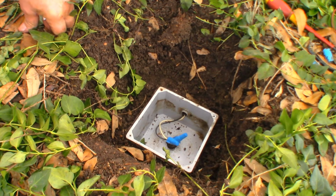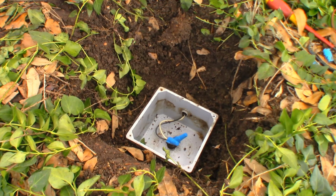So that's where we got our short, inside the wire nut on the positive side. What I'm going to do is dry out that connection that's going down into the ground and see about squirting some urethane in there and try and get that box a little bit more weather tight, so this repair will last a little bit longer, or this repair will be permanent. Let's get this done. Okay, let's get some eyes on it.